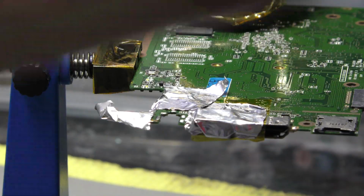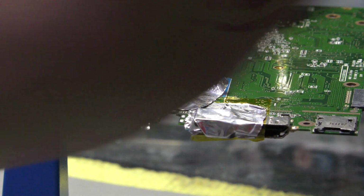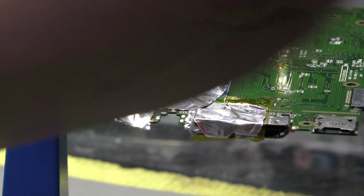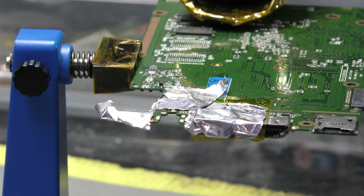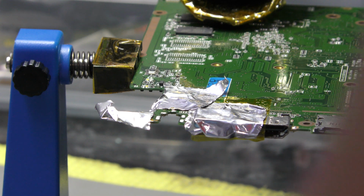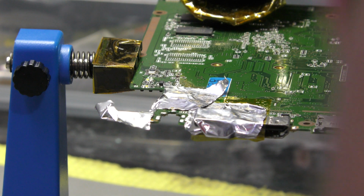The difference between the two ports is that the one I've taken off has got an anchor type of finish to it, whereas this is just like an L shape. So the new one's kind of an L shape. This is an anchor. So what I'm going to do is run a bridge from that L shape onto the PCB's positive rail because it's not long enough to do the job for me. And that's where I thought I'll share this, that this particular anchor type is not available.